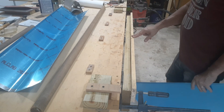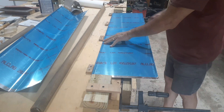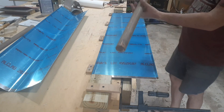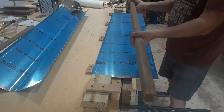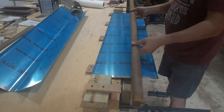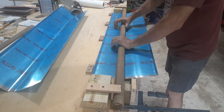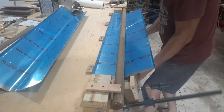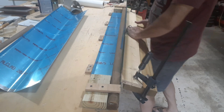With this 1x4, I just kind of lay the sheet metal down, and I take this — it's like a closet hanger rod. I had to cut it down; it was like 12 feet long. I just slip that underneath these locks, make sure I'm up against the stops, and give it a bend to get it over.